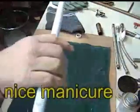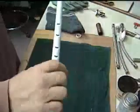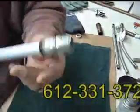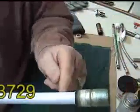It's designed to put cold water — as you can see it's quite long — put cold water at the bottom of the heater to force the hot water out the top on the hot side. The hot water side does not have a dip tube; it just has a nipple in it like this, and the water goes directly out.